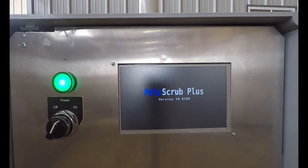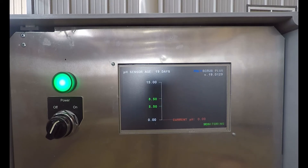The screen provides the operator with data and status information about the current pH in the scrubber bath solution. The panel door has an LCD screen and an on/off switch. When on, the unit monitors pH of the bath solution and measures probe life. The screen shows a relative position to the allowed pH window provided by the customer, as well as the specific pH value of the current reading. If the pH value is read outside of the allowed window, a trip sequence begins.